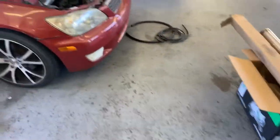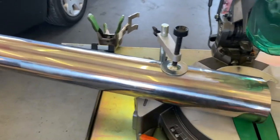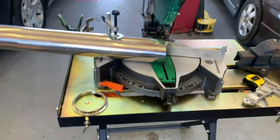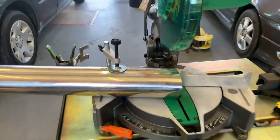I figured this cannot be that hard if we just go one piece at a time. Spot welds to hold it together — that way we can undo if we don't like it. I've got a lot of pipe to work with and I plan to shoot that thing straight down at the ground. You can see the wastegate dump goes down the same direction, so this pipe is going to sit right above or to the rear of the wastegate dump. Just reporting on my first cut — before I take it off the clamp I'm going to draw a line right along the top, then go 11 degrees the other direction to get that first pie. I'm already looking at that angle and thinking it may not be enough, but we'll keep moving forward.